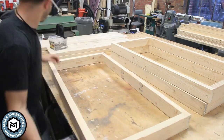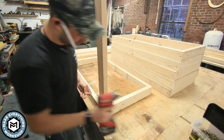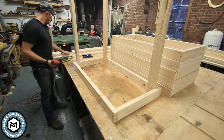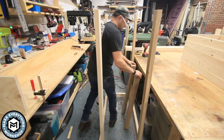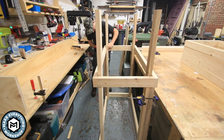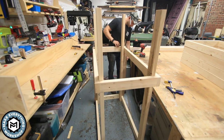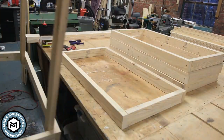Everything is going to be tied together by the screws that I put through the half-inch sheathing. I build the three rectangles and then start adding in my verticals, using the corners to make sure everything lines up nice. I'm driving in screws at opposing angles so they're pulled tight into the corners. Since I cut all my material the same length, I know these frames are going to fit on one another. I'm using spacer blocks to make sure that the middle divider is high enough, since these are designed specifically so that a keg can fit inside the wall.